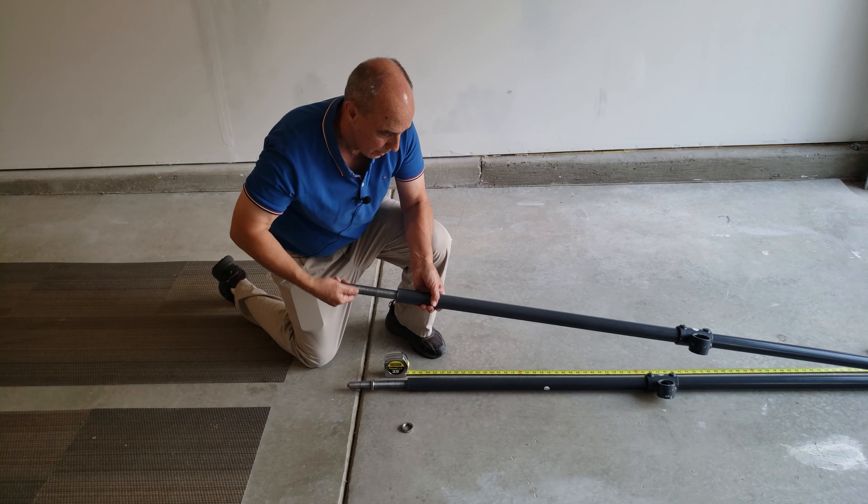If you need to, really get it where it needs to be — you might hear your ceiling start to give a little bit, but the joists will hold it and you'll be fine. Just tighten it up, don't get it just half tight, get it really tight. Then take your jam nut, take it all the way up to the bottom of the bung. Put your pipe wrench on there, hold the pole from moving, and tighten it up. After adjusting, it's good and tight. Now you can take the tape off the cover plate — it slides down and covers everything. Voila.